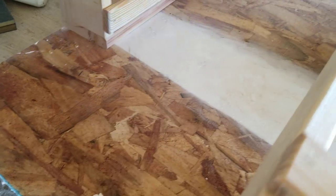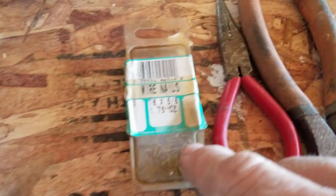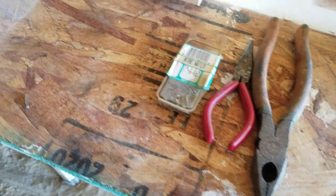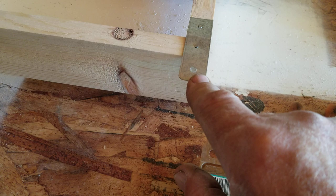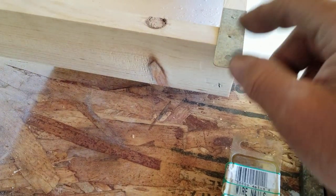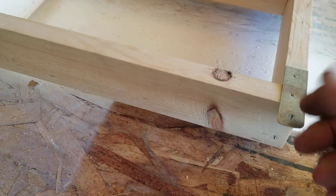Let's see if I can turn this one over. You can see where I put the two little brads in there. They're not actually called brads — they're called wire nails. These are 18-gauge by 5/8ths. I made these little hangers out of some scrap galvanized metal. This is like 22-gauge — it's not very heavy, but it's great for making hangers like this, and they won't take up too much space or hold it away from the door.